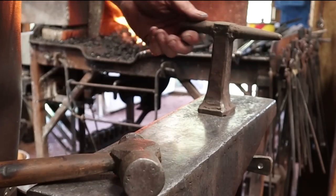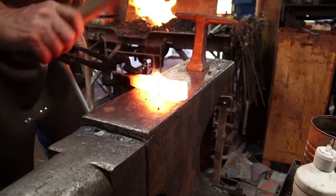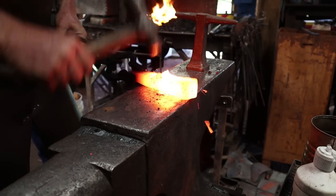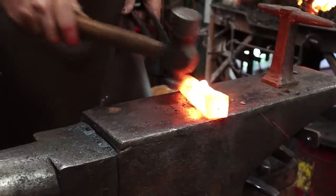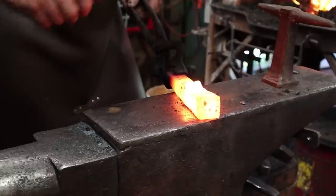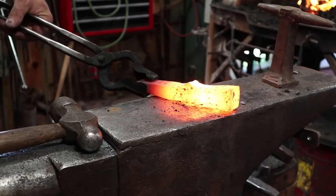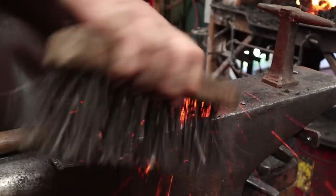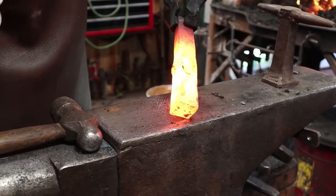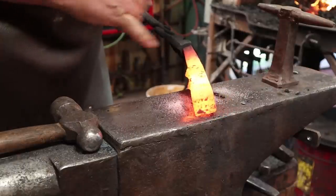At some point I'm going to come over to the stake to work from the side. Light quick blows right in there next to the eye, which of course deforms it. I wish I had a hammer with a longer handle here. I'm just treating the other side the same - it doesn't actually need to be welded, so I'm not worried that it isn't at welding heat. As you can see how badly that collapses that eye in on itself - it starts to really make a mess of it. As far as I can tell we haven't solved the problem, but we have made it pooch out a little bit, which means when we go over the little stake in the next heat, that might help us get that to go together.